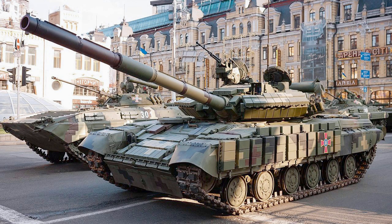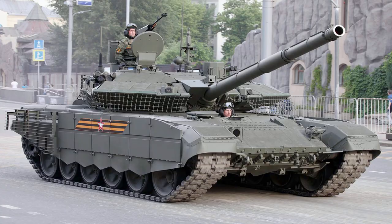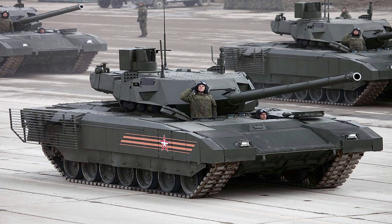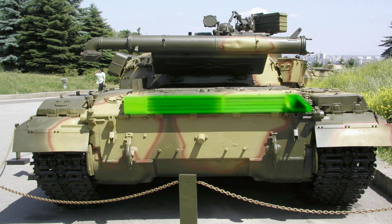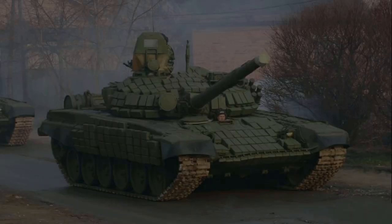The tank models are T-64, T-72, T-80, T-84, T-90, and T-14. The simplest parts of the tank by which they can be recognized are the road wheels, the driver's periscope or periscopes, the exhaust, the placement of the fording tube, or in some models which side the infrared searchlight is placed at the front of the turret. In some cases, it is also helpful to know how the machine gun is placed on the commander's cupola, which is located on the tank's turret.